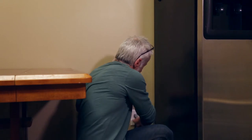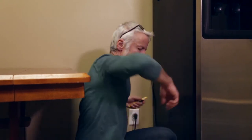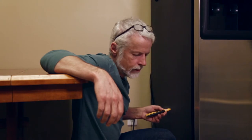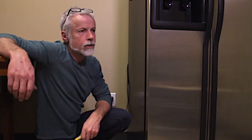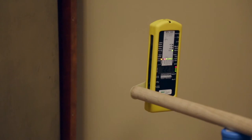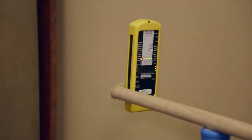So now I'm going to change the fridge to an ungrounded condition. And you can now see the volt sensor is clearly detecting a much more elevated electric field. And our meter reading, just in potential free space again — Larry, what's the reading? It's going up, 22 times, at 22 volts per meter. Even if you go out here, it's still 18, interestingly enough.